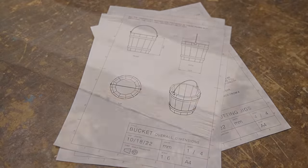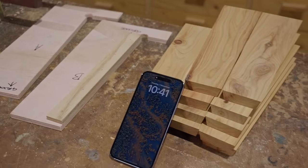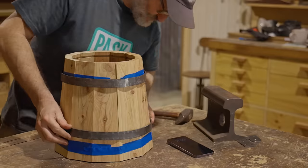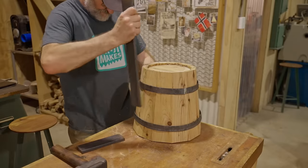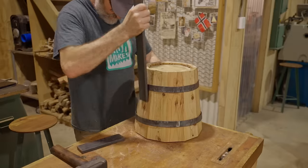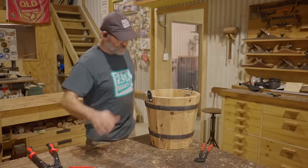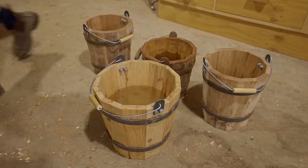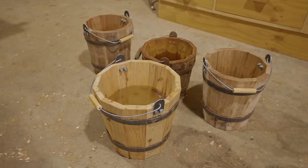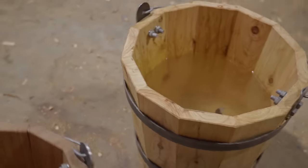I've made changes to the plans and reprinted them, and I want to make another quick bucket off camera from soft wood — I'm going to use this rough sawn cypress. It took an hour to mill and cut all the staves, including making the jigs, and I've also glued up the bottom piece. It took about another hour to make the rings and the brackets for the handles, and I also shaped the bottom — it didn't need any finicking this time, it went together very easily. I really wish I'd used this wood from the start. Anyway, it took about 3 hours to make the whole thing from start to finish. It did leak very, very slightly but hardly anything, and I didn't hit the rings on that hard so I could have probably closed it up even better — it did swell up and seal in no time at all. So the moral of the story is: use a softer wood and you'll have no issues.